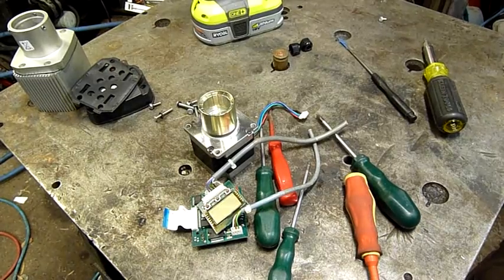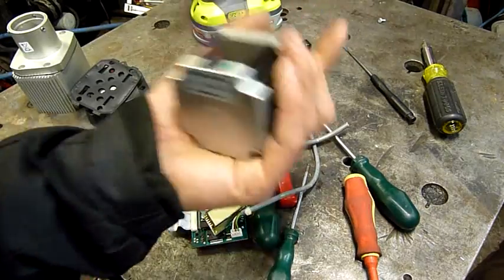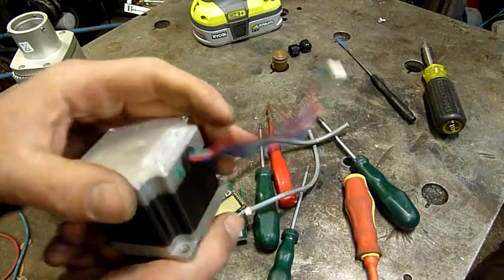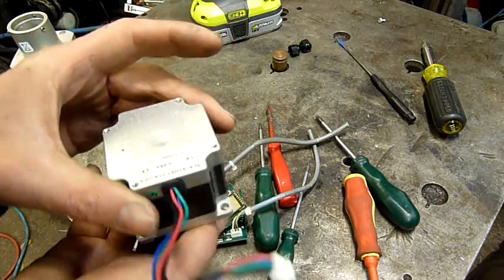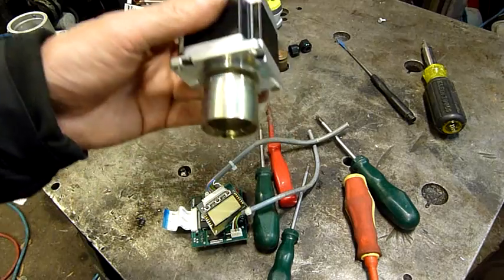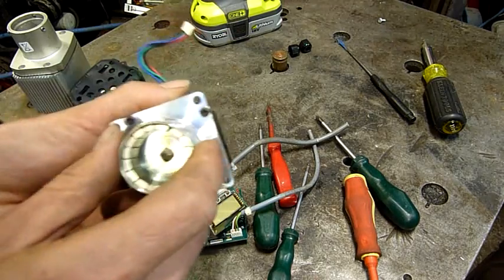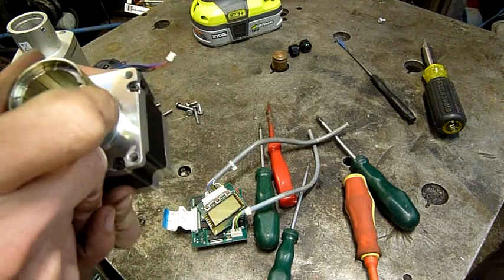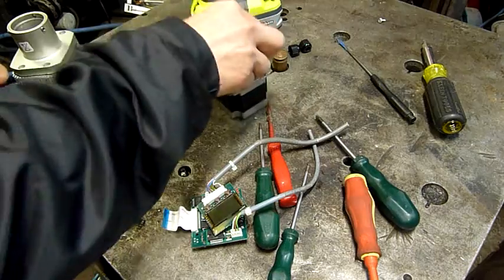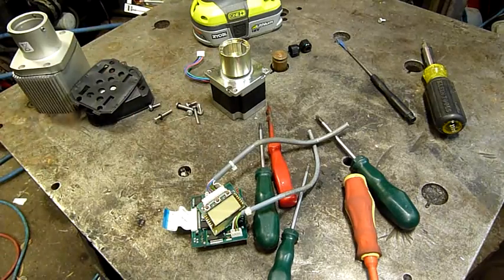I think that's about the end of that one — I'm getting hungry so I'm going to go inside and have something to eat. I hope that keeps you occupied and I hope you enjoy it, because I wasn't expecting to see a complete stepping motor like this — maybe something more custom. But that just looks like any other stepping motor from a photocopier or similar machine. It's a shame they've peened that edge over and attached the magnet housing permanently — I'll have to work on separating that somehow without destroying the motor, or I'll just find another motor. It's just a four-wire, two-coil motor. Anyway, that's all for now — thanks for watching.